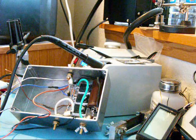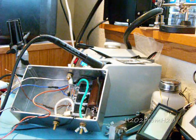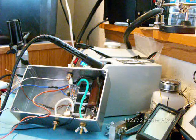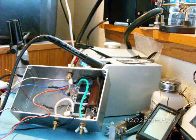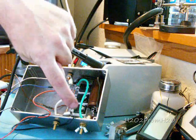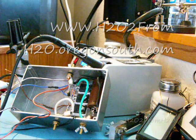Good temperature is between probably 800 to 900 degrees. My station goes up to 842 maximum. Bigger tips will sink more heat. If you've seen what they call a soldering gun, that will put a lot of heat down on the tip — it's really designed for applications like this where you need a lot of heat in one spot. On my first unit I used a blowtorch and that worked really good, but you have to be careful because of the insulation — you can actually burn or catch it on fire. One trick to protect your insulation is to wrap it with a little bit of tin foil and make a little shield for the plastic areas.